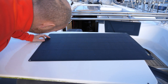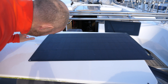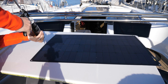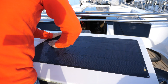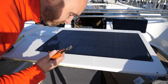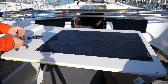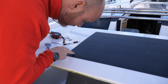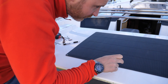So I'm doing everything I can to make it easier the next time we take these off. Let's get this butyl tape in, get the wire in, and then I can start Secaflexing the edges. This would be much easier if I had my workbench — I could just put it on the pontoon and work on it there, but it is what it is. I'm going to use these clips to secure the cable on the underneath. Next step: I've cleaned up all the edges under here and I'm just going to put Secaflex under the corners and a little bit in the middle as well.